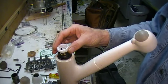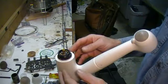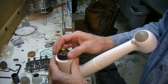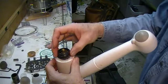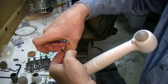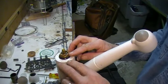Next is our little temperature limiter — this can be adjusted to limit the amount of hot water that comes out. And now finally just one more little clamp piece. Normally this piece will be in here pretty tight; you'll need channel locks to loosen it. I've just pre-loosened it for demonstration purposes here. Then there's a small little ring here, and now we're finally down to the cartridge and ready to take that step.